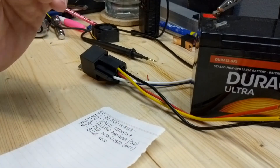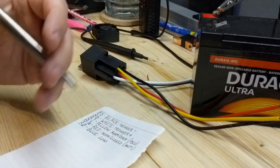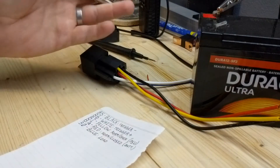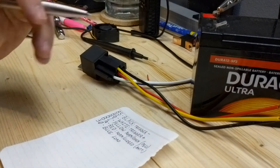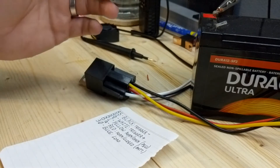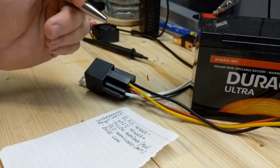To make a little battery bank, we're going to run two 12-volt SLA batteries in parallel — that doubles their capacity while keeping the voltage the same. We're going to hook up a charger to them and then use a relay — a little 12-volt automotive relay — to basically use as an automatic transfer switch between the power supply and the batteries.